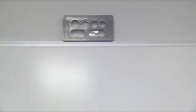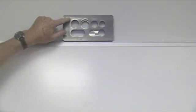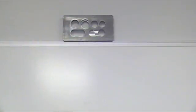The sample part has 4 different drilled hole sizes, 2 ID chamfers, 1 counter bore hole, 2 slot widths, and perimeter side milling and chamfering. You may have similar requirements, though spread between several parts. However, the cost savings potential is the same, and most of the savings is achieved with the reduction of excess tool inventory and tool change time.